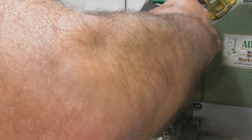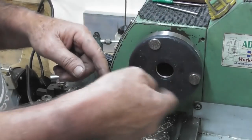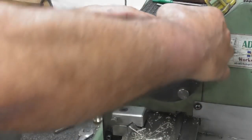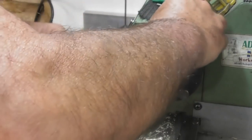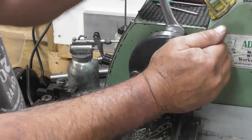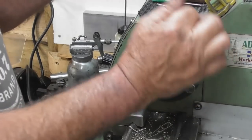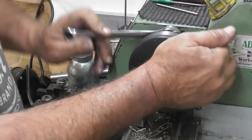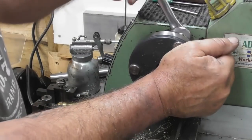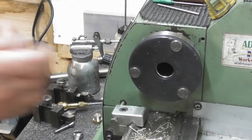Bolted it on and then turned it in situ to fit the headstock here. Fits on the little rebate within and just protects all this area while I haven't got the chuck on and while I'm using the Morse taper. And I'm all fingers and thumbs. Normally this is dead simple. So nuts on the back, the same as we do with the chuck. No need to go mad, I'm only pulling onto plastic, it grips to a certain degree. So yeah, a 99p chopping board from somewhere or other, turned it up to do the job. 3 little studs, nuts on the back, the same ones as we use on the chuck.